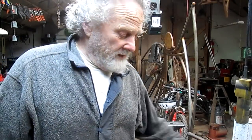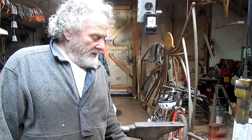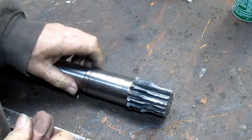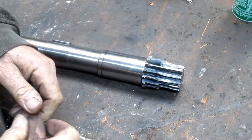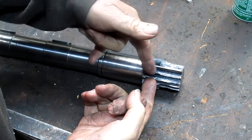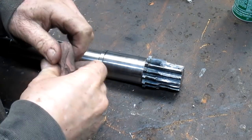So in the next couple of days we've got a cutter coming, but first we've got to take some measurements from these two teeth. Right, first thing we're going to do before we take any measurements at all is we're going to get a contour, and it looks to me like this tooth here is about where we want to do. I'm hoping to get a contour of these three valleys, 1, 2, 3, with some oil clay.